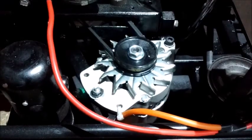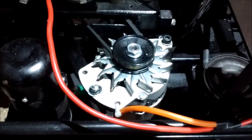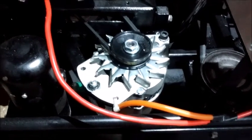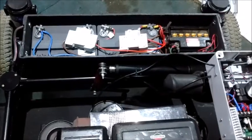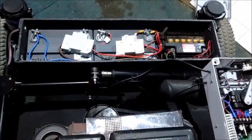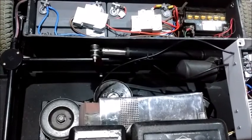The topper uses 24 volts for the four main drive wheels. The batteries would not provide enough current for long enough to be useful, so I fitted a 24 volt alternator that is driven directly from the engine. To adjust the height of the deck, I've used an electrical actuator that operates on a bell crank that lifts the deck to the required height.